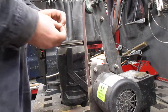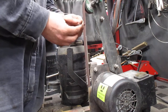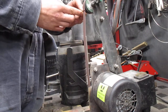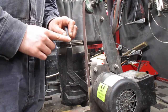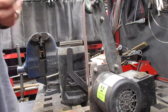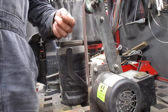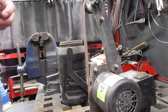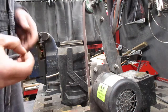What I'm going to be doing here is use the slack portion of the belt to create all of our rounded edges. What's important is you want to maintain even contact and pressure on all surfaces, so you're not taking away more material in some parts than others. You're also going to want to dip your metal into water every few seconds of contact with the abrasive, because once most steels reach 350 to 400 degrees, they start to lose their hardness. If you see your metal starting to turn a straw yellow color, you need to dip it.